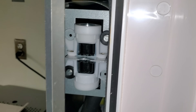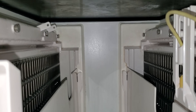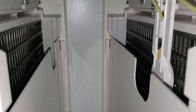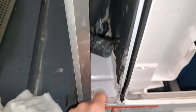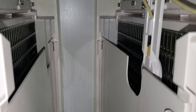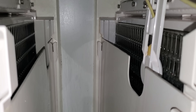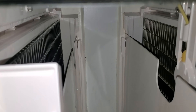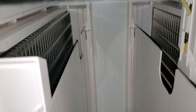It's been running for a couple hours while I went and got the parts. Put the new air pump in — it's super quiet, running like it should be, no problems there. We've made a good deal of ice since I've been gone. Let's just watch these last two fall off and then we'll be out of here. I wiped down this side of the machine because it was a little dirty. Looks like the right side is going to dump first — that's pretty common on these Manitowocs. Nice, good thickness — I can tell by the sound.